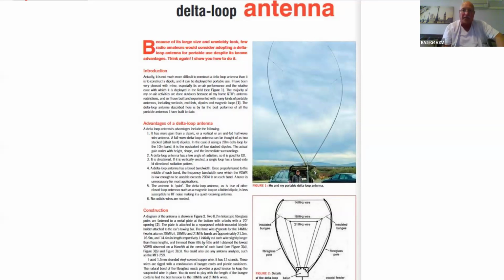Another good point that you didn't mention, Hiroki, but if I can just mention it, is when you put this antenna up, you're beaming, and I use the word beaming in inverted commas, both short path and long path at the same time. So if there is a question over the propagation, then you are in straight away with your long and short path, whereas someone with a big 3-element or a 5 or 6-element beam has got to turn his antenna. So that's another advantage.